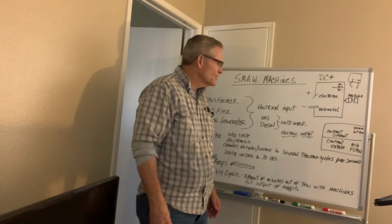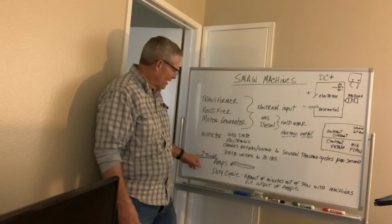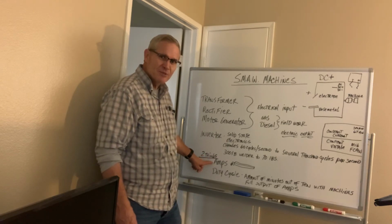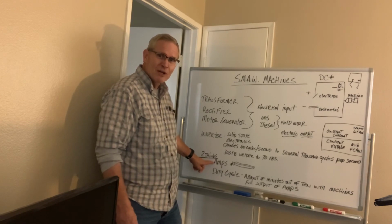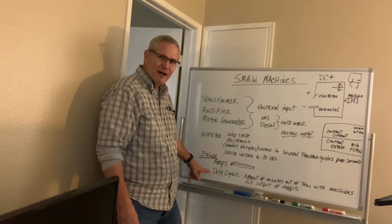So I think that wraps up my talk on the machines. Always keep in mind when you're going to buy a welding machine is amperage. How many amps does the machine put out? And how many amps are you going to need when you're going to be doing your welding? And also the duty cycle.